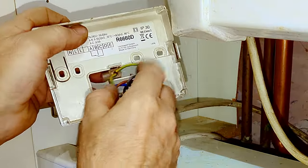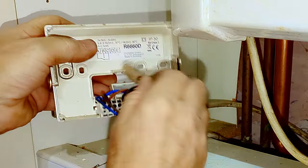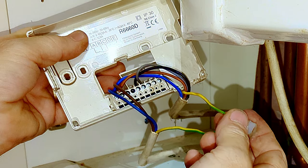Let's take a look more closely. Here we have the earth wire which comes in on that three-core flex, and they've used an electrical connector to join the earth wires together to take earth up to the boiler. There's also the brown and blue on that three-core flex — that's live and neutral — linked again to the five-core flex taking live and neutral up to the boiler. Then we have the black and the gray, which are the two switch wires to turn the boiler on and off.